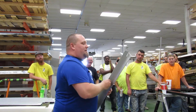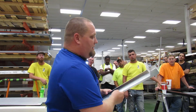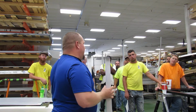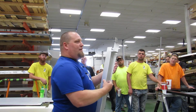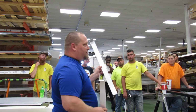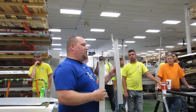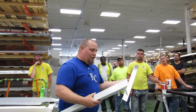So wrapping corners with brake metal, which is happening more often, same thing. If you have L angle that you're wrapping, one of the first things we need to know is when we wrap our L metal into the opening, we have to tie it into the air barrier afterwards. Because if there's an air barrier on the building and you put this on and there's nothing that can stop water from getting from this backside and in, we've just ruined the water protection from the building. So sometimes they're okay with just putting caulking on this face, putting it in, and going with it. Other times we have to put this in and this gets stripped into the air barrier or caulked into the air barrier. So if we're wrapping an opening